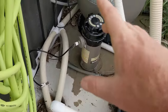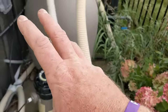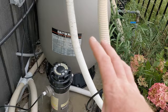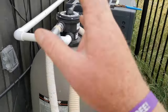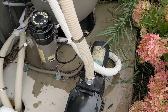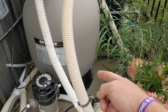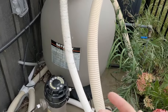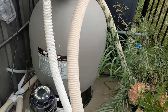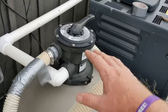On the equipment side I think we're done. This is so basic — if you have any questions just put them down below and I'll answer them. This applies to any pool you have, any equipment you might have — other pumps, other jets, waterfalls, whatever. The biggest thing is you need to blow all the water out. Double-check everywhere — the filter drain plugs, plugs on the pump — just get all the water out. If you have to shop-vac it out like a cartridge filter, do it. If you're in an area where you don't want anything to freeze when shutting down for winter — up here in Florida or California, don't worry about it.